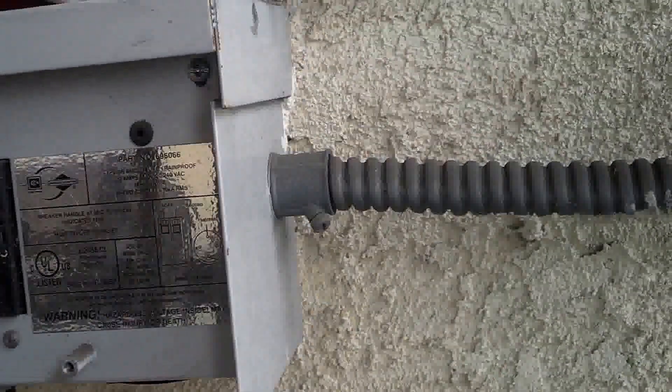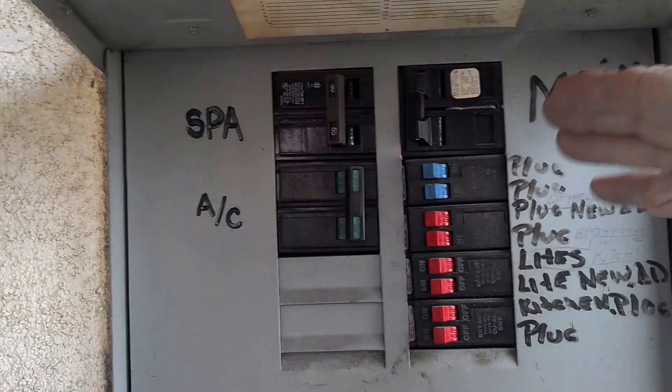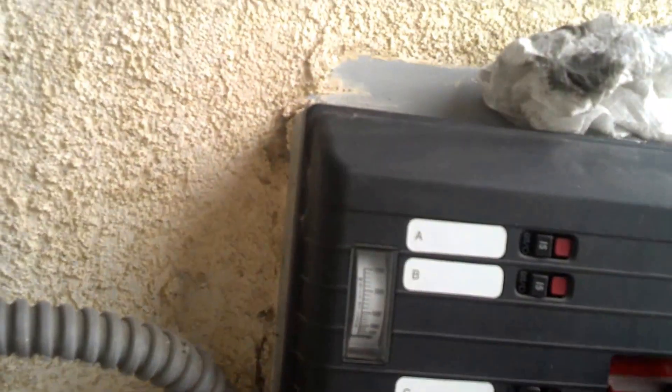Well, you've got to pull these first. Take your main breaker on your main — turn that off. Turn this on. And then you just go through here and kick these breakers, and you've got power all through the house. Is this the main switch to get everything going? Yeah — you've got to kick that main switch, then kick all those switches there, and away you go.